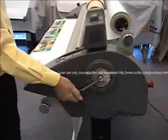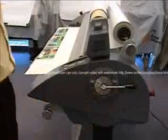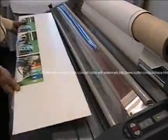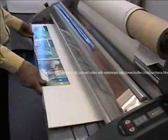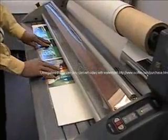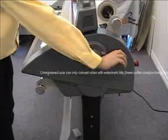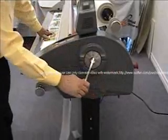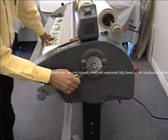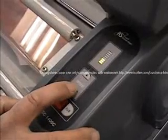Make sure the laminating rollers are in the fully open position. With the rollers open, take the straight leading edge of your leader board and use this to push the film and backing paper into the laminator. Close the rollers now until you feel pressure, which will vary depending on the thickness of the leader board. We suggest all new users start everything at speed 1.